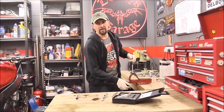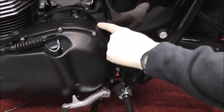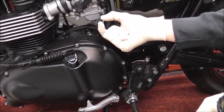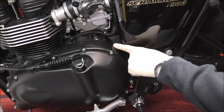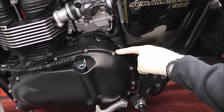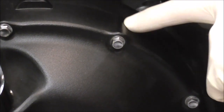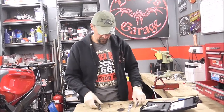Now at this point you could argue, why don't you just put a bigger bolt in there? You've drilled the hole out a bit bigger, you've put a fresh thread in it — just go up to an M8 and bung a bolt in. I'll show you the problem. With a lot of these engine casings, you've probably got no more than about six or seven, maybe eight mil of thickness in this casing. If you're going to put an eight mil bolt through a six mil hole, it's not going to fit, so you'd have to drill this hole out bigger as well. And you have not got enough meat on the casting to drill that out to eight mil and still have the strength required. You'll weaken that casing and split it. Some applications you can — like a fork leg for a mudguard — but not in this instance.